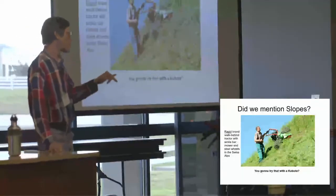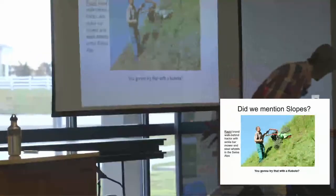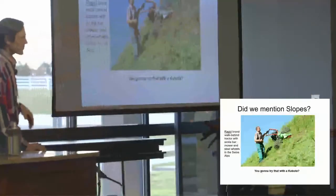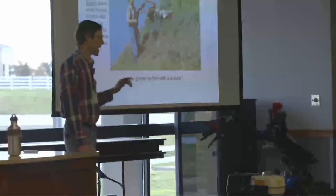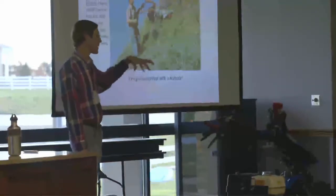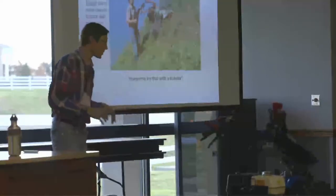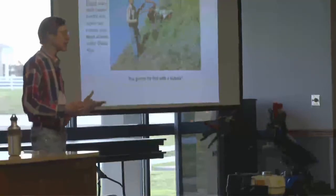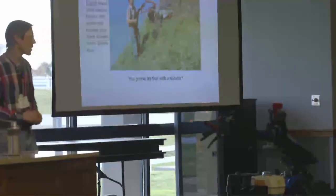This particular tractor right here has a hydro component. Does this one say hydro? Yeah, it says high on it. This is the first walk-behind tractor introduced in the U.S. market that actually has a hydraulic component in the transmission. So it has gears driving the hydro pump. The hydro pump then drives the gears that drive the wheels. So it's like a hydro over gear system. The hydro just gives you infinite speed variability and the ability to shuttle back and forth between forward and reverse without using a clutch. That's nice, especially for mowing applications.